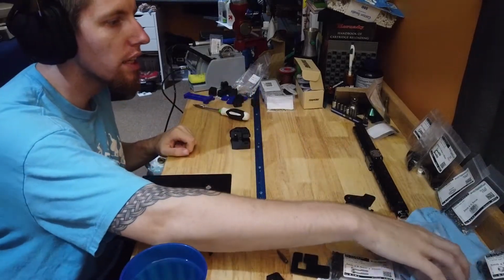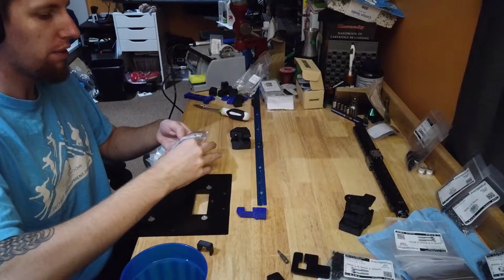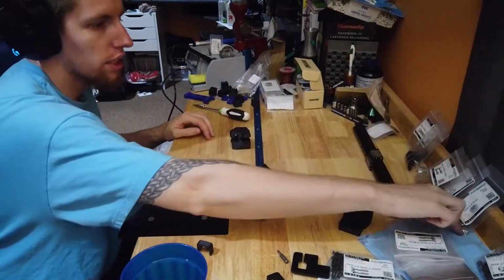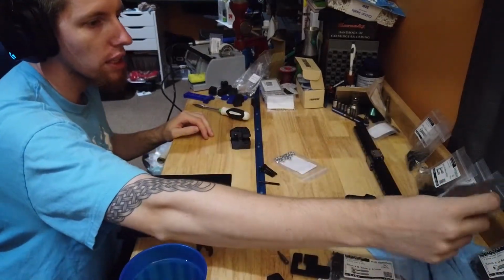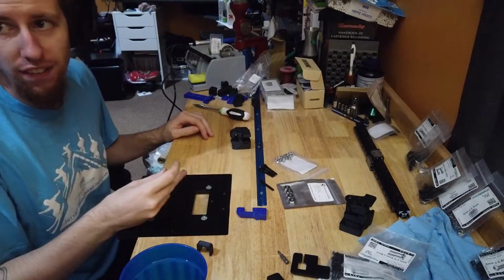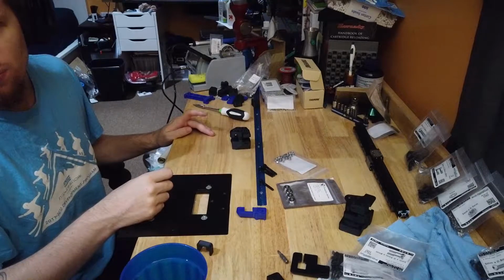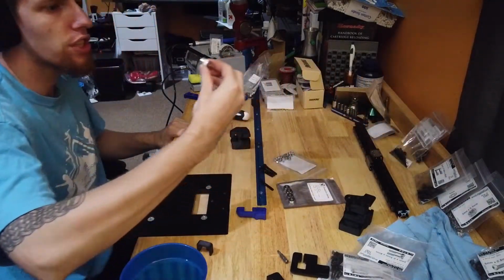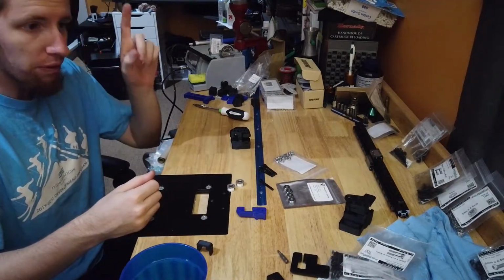We are going to need our remaining M5 by 40s. We need 4 per. Some M5 nuts. Our remaining 695s. And a GT2 6mm wide 20 tooth idler, which is not those. So I've got those. Oh, and the shims, which are over here.